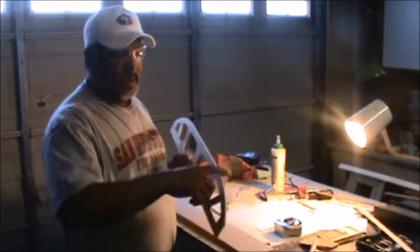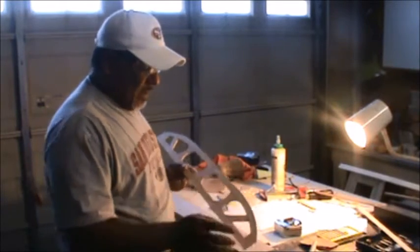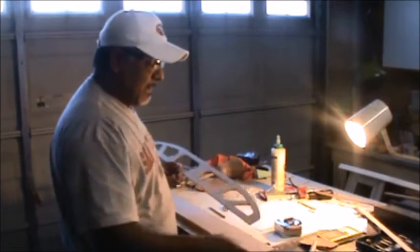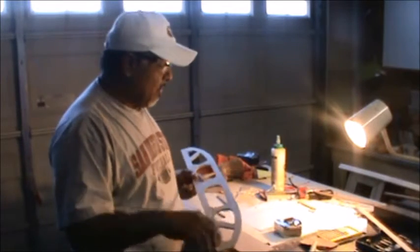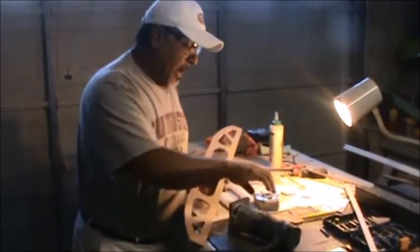I'll cut the round pieces on the bandsaw, and then I'm going to use a router to cut the inside. Since it's only like 3/16 or 2/16 less as it progresses, I'm using this as a pattern for the first couple, and then I'll change it as I go along. So I'm just hand cutting these with a router, just doing it freehand.